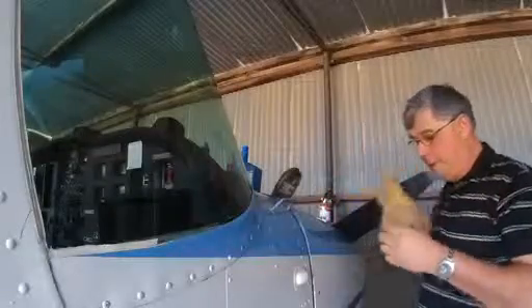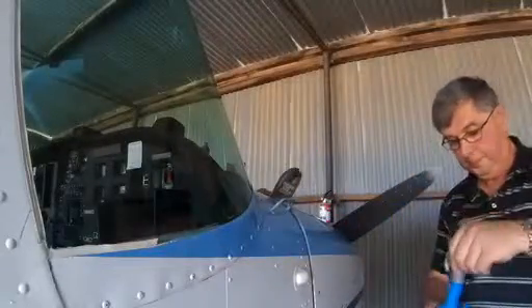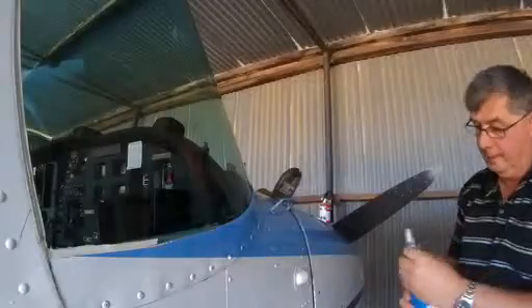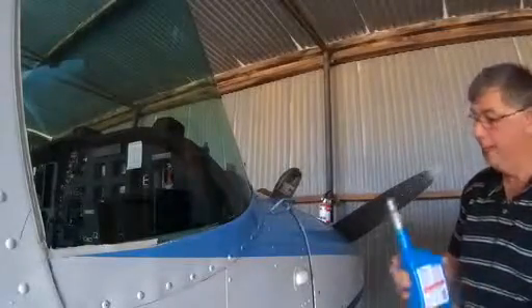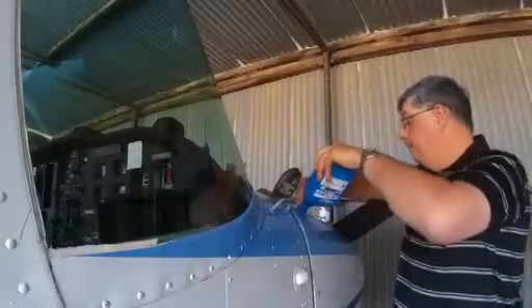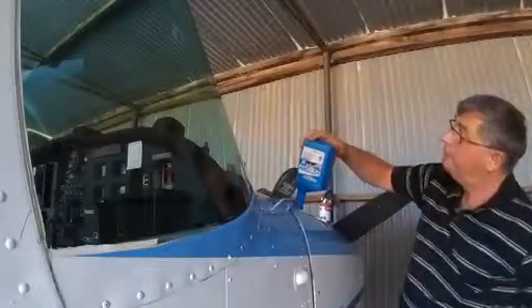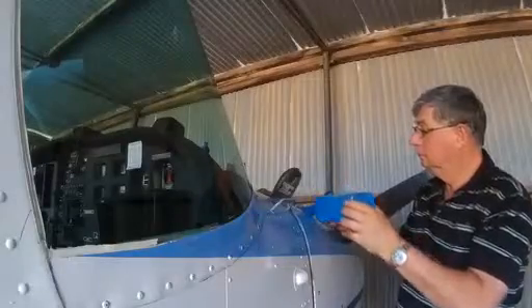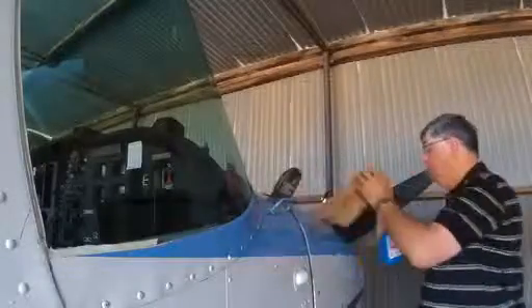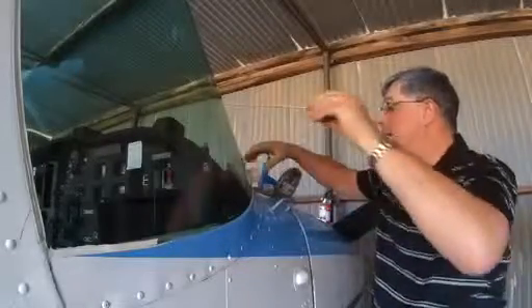The actual filler is well underneath the top of the cowling, so ordinarily you'd really spill oil all over the place. What I'm putting on the top of the bottle is a special extension with a little tap on it, so I'm able to turn the tap off, get the extension into the filler, and then when I'm ready I just turn that tap around and it flows through. That's proven to be a really handy little extra to have to get things done on the aircraft without making a big mess.